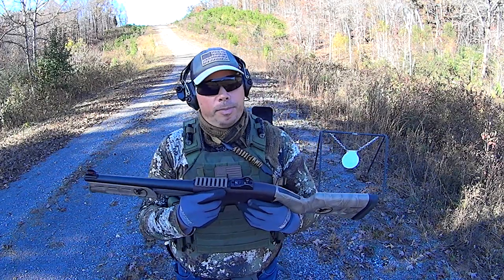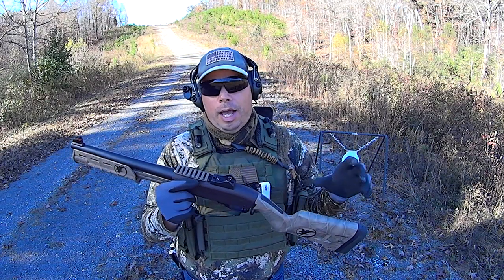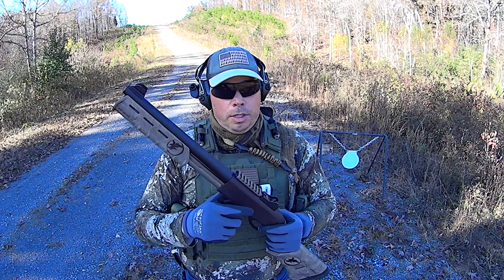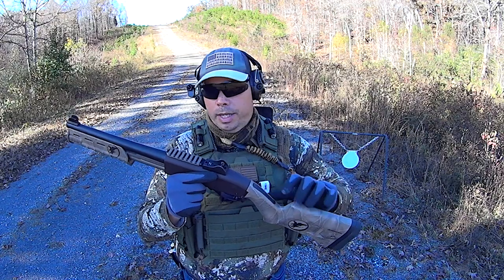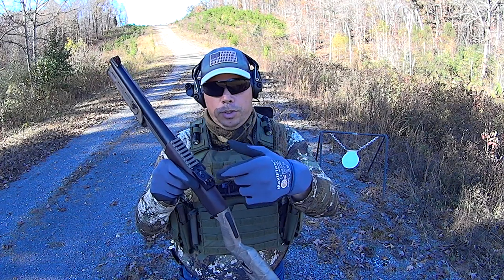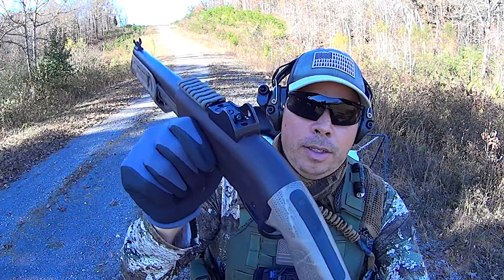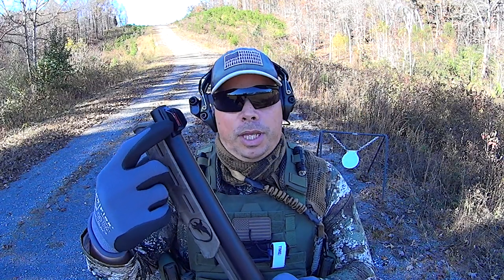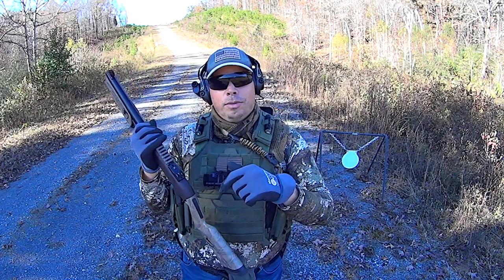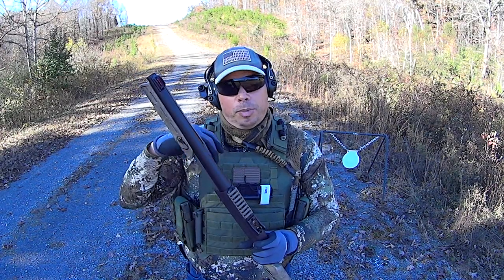An old-school 870 Express Magnum — not the crap that Remington was putting out near the end. To stay legal before I did the paperwork on the receiver, I told the two parties: Hillbilly 223 hung onto the barrel and the furniture, Craig Golson hung onto the receiver because they had to drill and tap for a pic rail and drill and tap for the LPA ghost ring — an adjustable ghost ring with a ghost ring sight. Eventually they also had to do the front sight on the barrel, but the barrel first had to be cut down, the ribbing removed, smoothed off for all the soldering, and then prepped for painting.